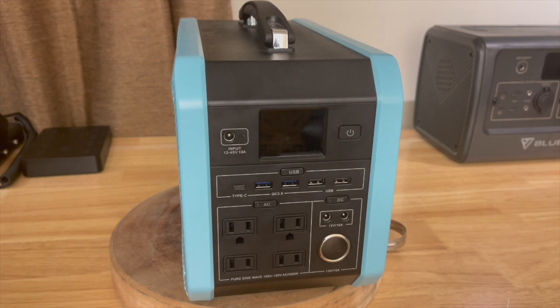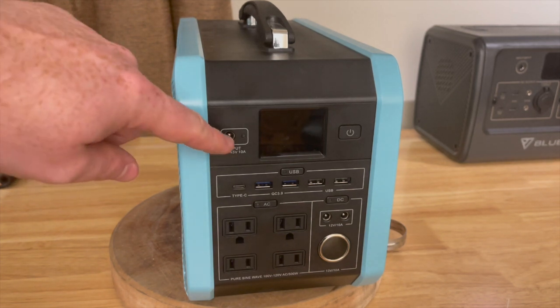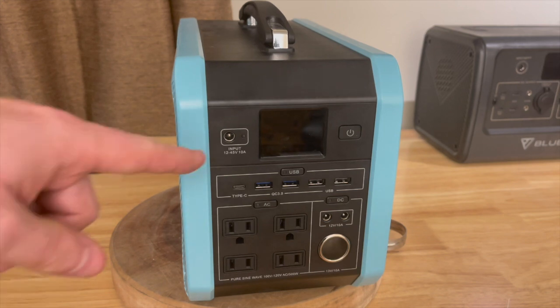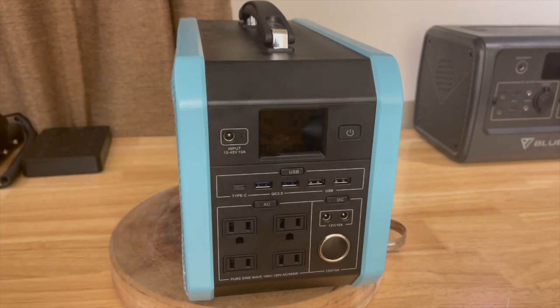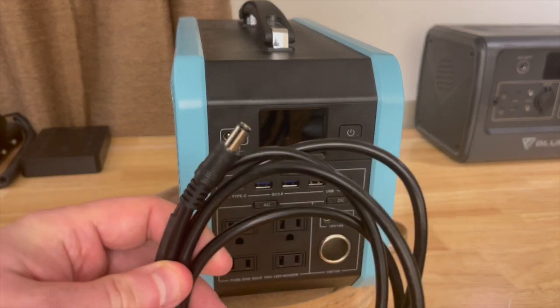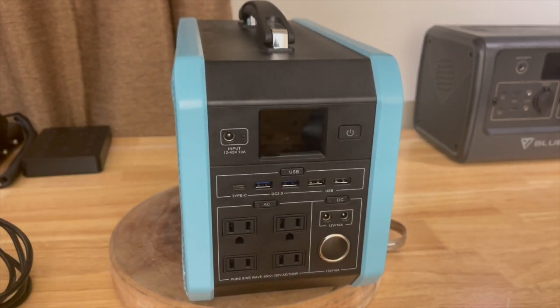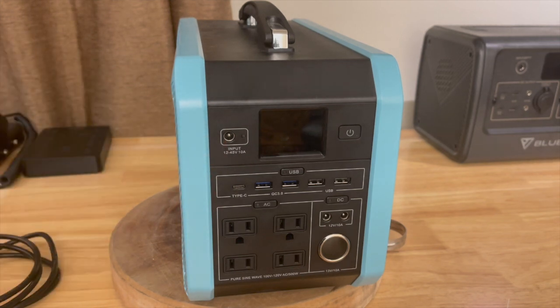The charging cords here are not the same size as a standard Bluetti 8mm connector. Most everything Bluetti makes uses an 8mm port, but this particular unit uses a DC 6530 connector, also known as a 6.5mm by 3.0mm DC barrel jack. It does come with the right cables, so you don't have to worry right away. If you lose the original cable, you can find 5521 to DC 6530 converter cables on eBay and likely on Amazon once more units ship.